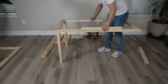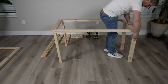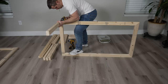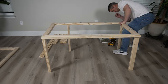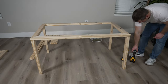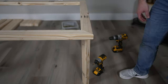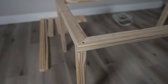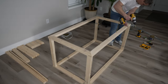Now that we have the bases constructed, let's attach our 24 inch legs. My first try didn't work out so well — if any woodworkers have a better technique, please let me know in the comments. Attaching these legs flush with the corners is important because we'll be inserting 4 foot pieces of polycarbonate on the sides, which is a tight fit. It's also critical that the narrow sides of the legs face towards the front, perpendicular to the 51 inch sides, and be careful not to run into any screws going sideways into the base frame.